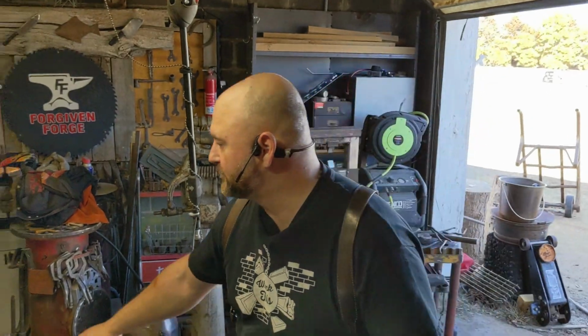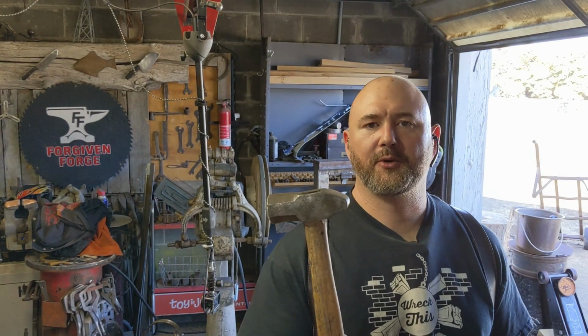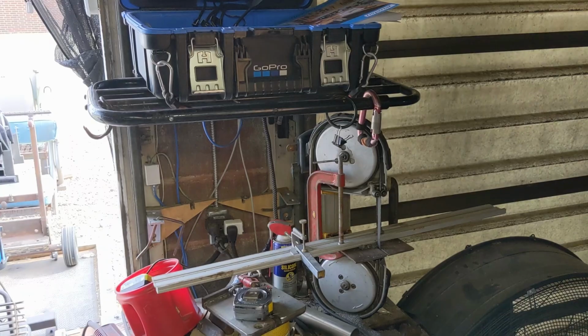And I like to use just, this is probably a 1.5 pound crosspeen hammer. It's pretty good. It does a nice texture. You could modify a hammer like John Bennett in his video. I borrowed a lot of ideas from him. Again, you should look at his video, but he took a ball peen and a cutting disc, and he modified the face of the hammer so that it made a texture more like rough sawn wood, more than kind of gnarly, really wavy bumps. And then you can use a ball peen hammer as well to do the texturing. That's not a bad deal.